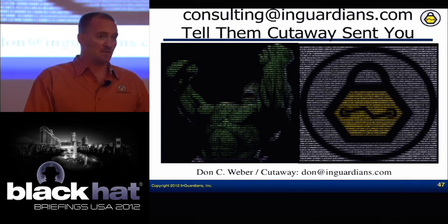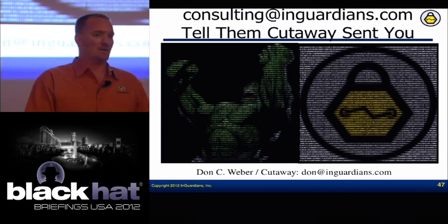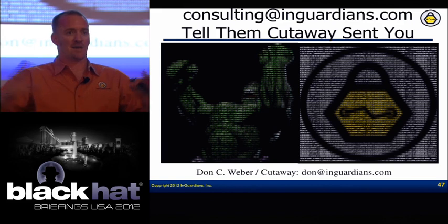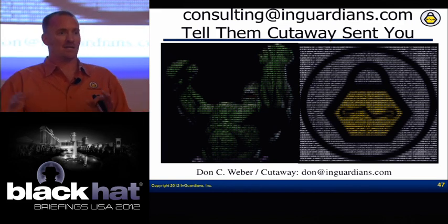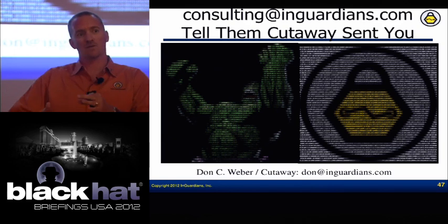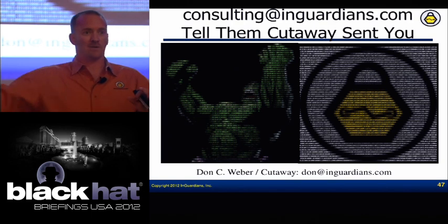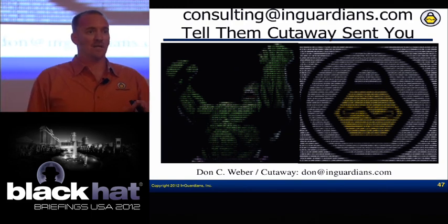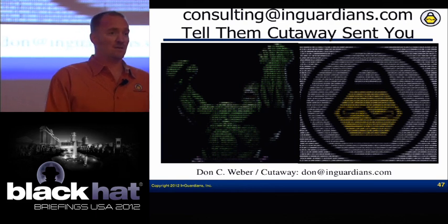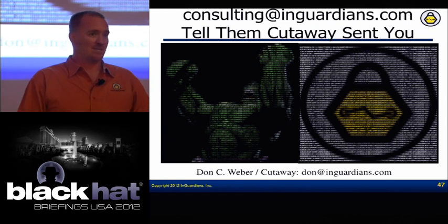That's why we have the fuzzing capabilities built in there, so that I can send my table reads, but as part of that read, I can make that packet huge. If I do my authentication normally, and then get to a certain packet and send 5,000 characters, does that meter reboot? If it does, then we might have an issue on the microcontrollers. And so we can test those conditions now, and we don't even need to open it up. Does that answer your question? Yes, it does. Thank you.